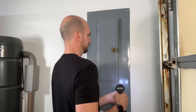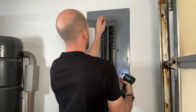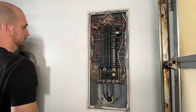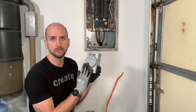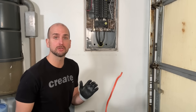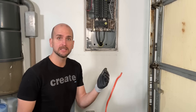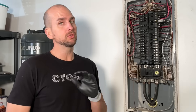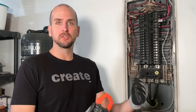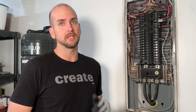I'll start by taking the cover off — removing the four screws, applying pressure at the top, removing the last one, then rocking the panel away from the surface. Now, how do you know if you need a 30 amp or a 50 amp? Which one is going to actually power your home and get your critical appliances up and running? Let's jump into that and test to see what fits your home's needs. If you're not comfortable doing this, don't approach the project — call in a professional, but at least now you'll know the steps you should be going through to get the right setup.